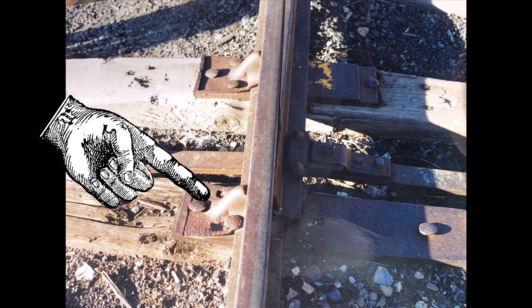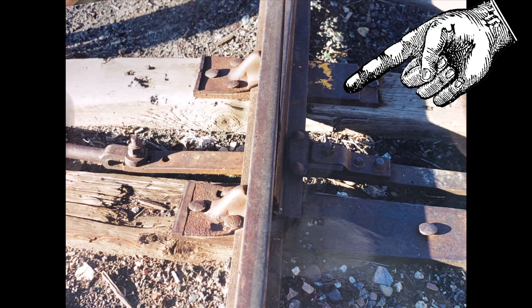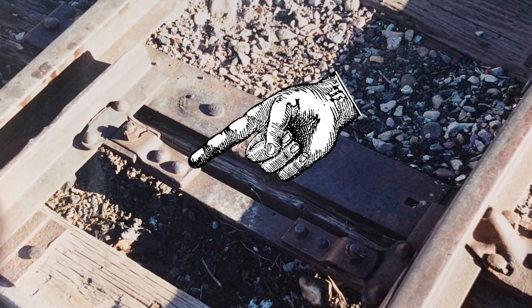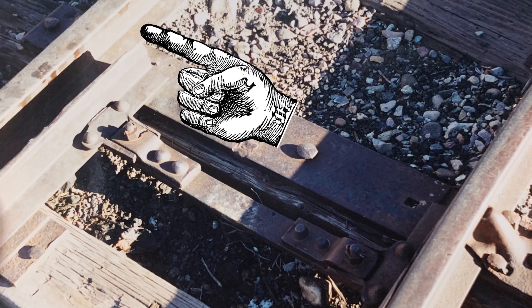Nothing is keeping the rail completely engaged moving inward, but all the forces on this thing are pushing outward, so these work just fine. The points slide across a metal plate — hence the name point slide plate — placed so that the points slide across metal instead of across the wood tie. Notice that the slide portion of the plate is so wide it meets in the middle between the rails and has been welded together. Over here is the linkage that holds the two points in separation and moves them back and forth to redirect the train. The point slides up into the stock rail with no modification or notching to the stock rail — only to the points.